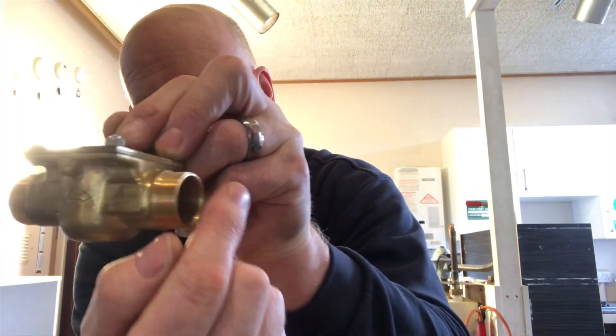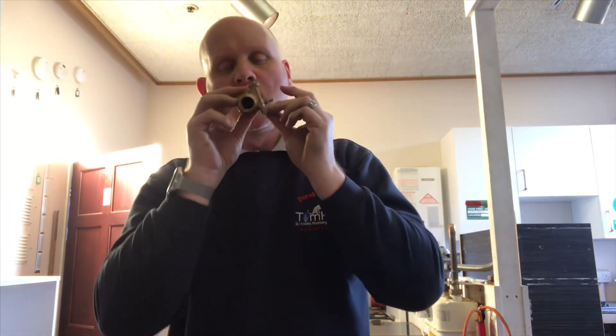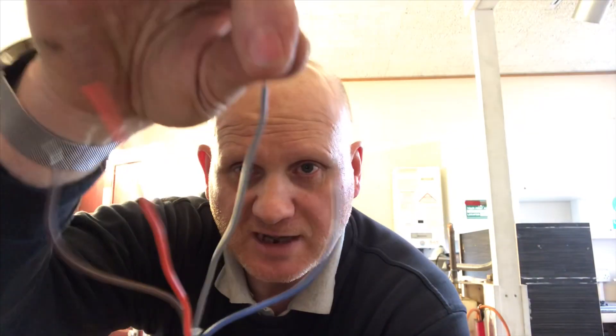There's a flow arrow, so this is where the flow comes in and the water comes out the other way. If I turn it off and blow — no water comes through. I then turn the ball, which allows the water to come out. For wiring, we've got the same colours as before: the orange and grey are now connected via a micro switch. As the stats move the valve it operates the micro switch, allowing the switch live supply to the boiler. Permanent live 230V comes down the grey wire; once the valve has operated it sends 230V down the orange wire — that's your switch live to the boiler.